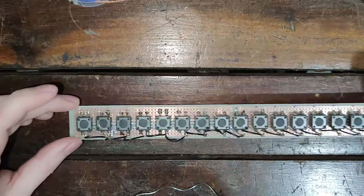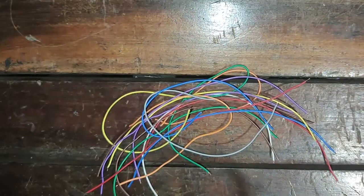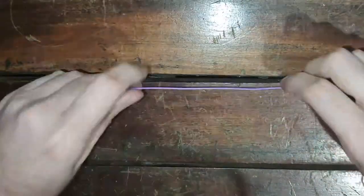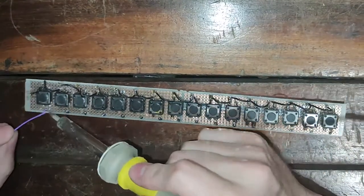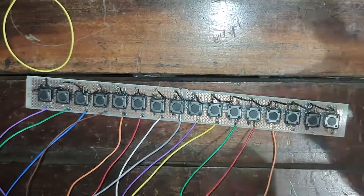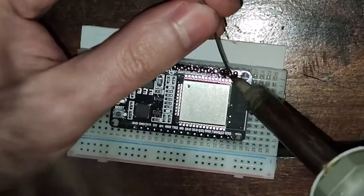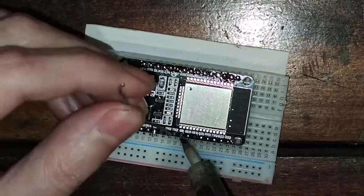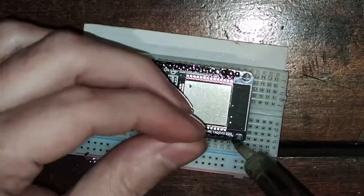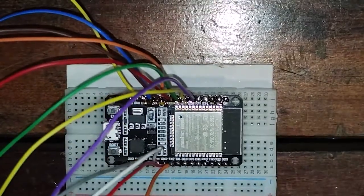Having connected all ground legs, we will now solder the connection wires between each button and its respective pin on the ESP32. The wires should be seven to eight inches in length each. First, apply a bit of solder to each connection spot and then solder the wire tip. Now let's apply a bit of solder to each pin of the ESP32 before connecting the other tip of the wires coming from the buttons. Carefully connect each wire to its respective pin. The list of connections between pins and buttons is in the description.